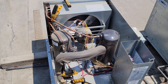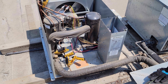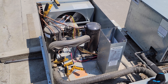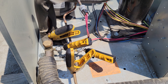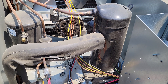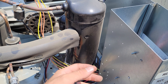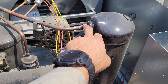Why is it that we would go off on high head pressure? A couple factors. Number one, your box temperature. The temperature inside the walk-in is 50-something degrees. That means the evaporator — the fan coil unit inside — is going to move air across, take the heat from the space, absorb it, and bring it back up to the compressor on the suction line. So you've got a warm box. The suction line is bringing the gas back because it's absorbing the heat into the refrigerant. It's going into the compressor, so you have a higher-than-normal temperature refrigerant. Then on top of that, you have the heat of compression. This compressor is going to compress the refrigerant, so you're going to have a low-temperature vapor refrigerant coming back, it's going to build up the pressure, and it's going to come out as a high-temperature, high-pressure, superheated vapor coming out of the compressor.